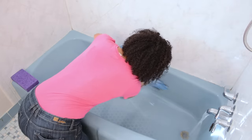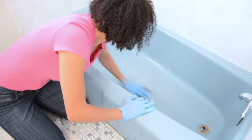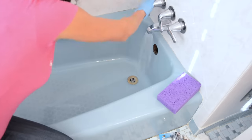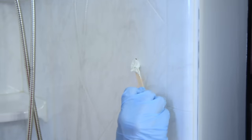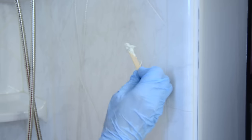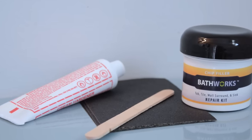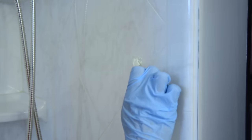Next, while the bathtub is still wet, use the sandpaper from the refinishing kit to thoroughly sand down the tub, paying particular attention to the drain area, then rinse really well. If you removed old shower doors, you'll likely have holes to patch or chips to fill — use the BathWorks chip repair kit, following the instructions to patch and sand smooth before moving on.